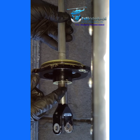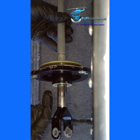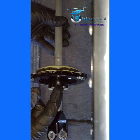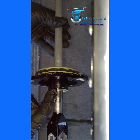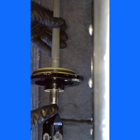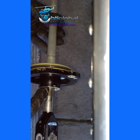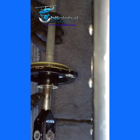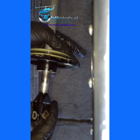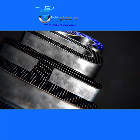The excluder's function is like a scraper, making sure any dirt collected on the tube does not go inside the gearbox. Over time, the bearing starts having play, and I'll show you later when everything is assembled what happens at the crosshead. You might have to replace the bearing if you find a lot of wear on the bearing in that section — you can see it shining where the excluder works on it. The maximum allowed wear is 0.050 inches if I'm not mistaken. It's good practice that whenever you work here, you rotate this so it wears evenly.